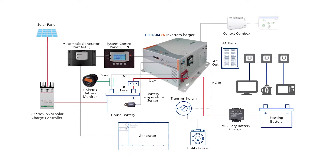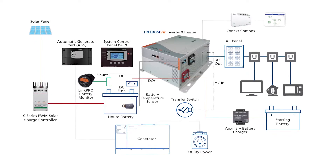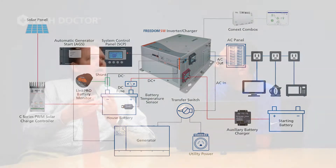Solar tends to be tied to renewable energy, and inverters tend to be tied to renewable energy. But the fact is the inverter attaches to a battery as it draws current out of the battery. The solar panels, usually through a solar controller, attach to the battery to put current back into the battery. The solar panels and the solar controller don't necessarily need to integrate with the inverter. So you can use any number of solar panels and solar controllers with any number of inverters — they just connect to the same battery bank.